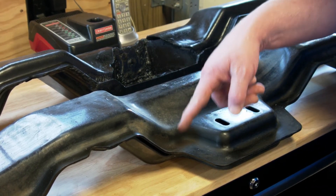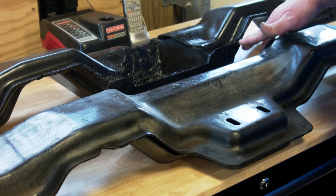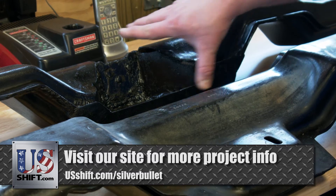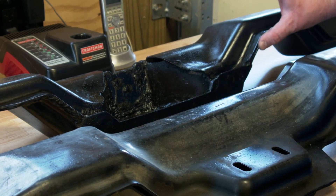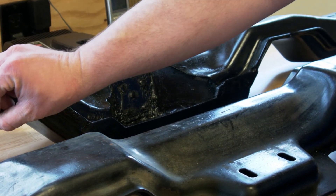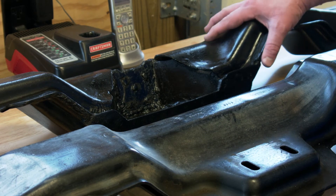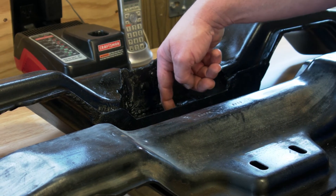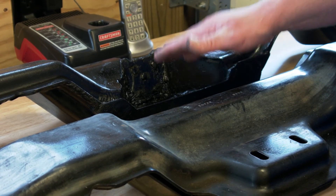We made those cuts and then cut off the front part. We cut into the weld seam by about a half inch, and we will publish some templates to show more or less what we did dimensionally. We flattened that weld seam, filled it as best we could, and inserted an eighth-inch thick piece of steel on each side to close up those gaps for extra rigidity. Once we did that, we basically had a shelf here, and this is the hole we drilled for the transmission mount where the single half-inch bolt goes through. We'll use spacer washers to adjust up and down as needed.